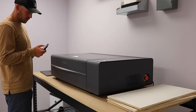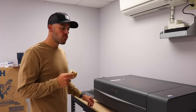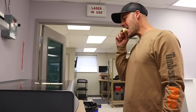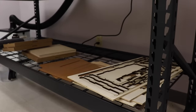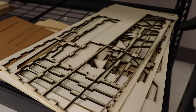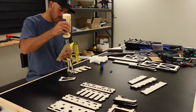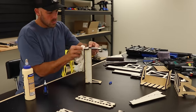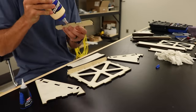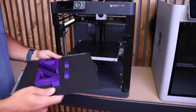I need to include the laser monitoring time in our comparison to be fair — it took about an hour of my time to reload material, start new jobs, and remove old parts. After the laser robot had its way with about a half sheet of quarter-inch plywood and acrylic, it was time for assembly. I designed everything to be glued together with tenons and box joints, so it was just a matter of getting all the parts situated. I used CA glue to help keep things together until the wood glue dried, and everything went together really nicely — only about 45 minutes total.